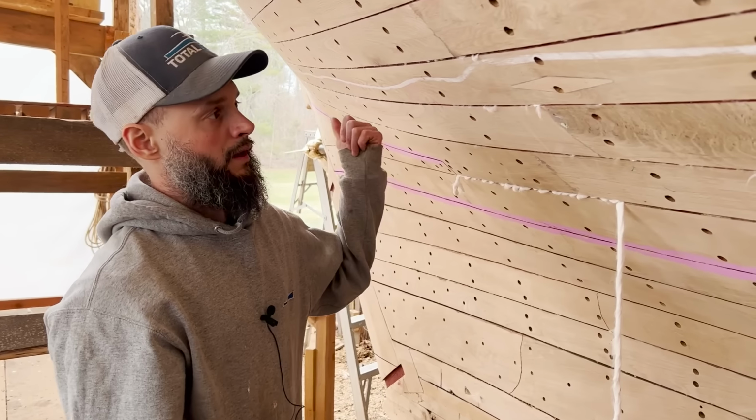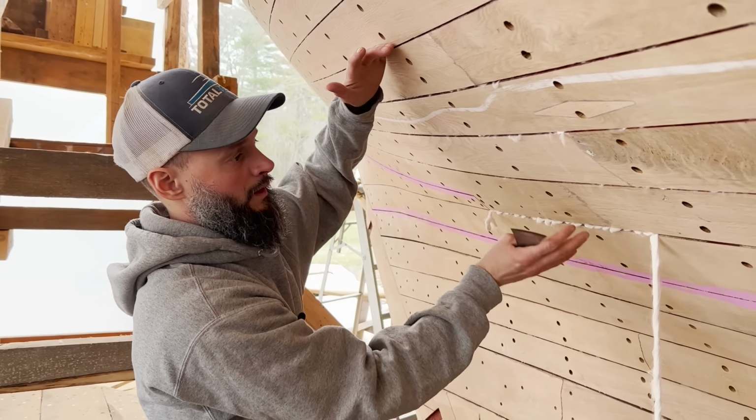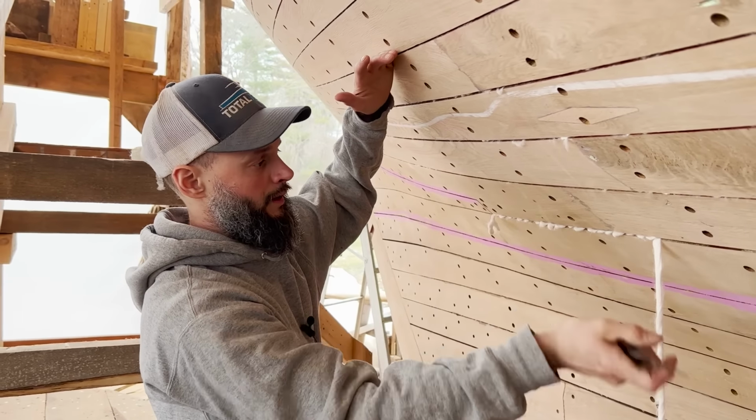From one end to the other, and get a section about yay big so that all the seams are stuffed and the cotton is just tucked inside, but the cotton isn't set or hardened. And then once those seams are all tucked in, then I can walk down and hit a seam that's tight, and then go to one that's a little bit looser and work my way down the boat and harden that caulking up. So it means that I'm going over the same seam two or three times,